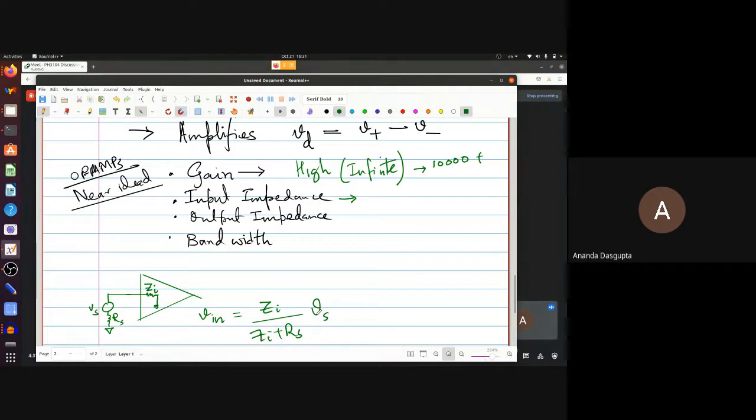Come on, that's a pretty straightforward and easy question. Why would you want the input to the amplifier to be large? For the output to be large. Good. Okay, that could be a good first starting point. After all, an amplifier can only amplify what it gets. The amplifier doesn't care how much Vs is, the source voltage. The amplifier does not amplify the source voltage. The amplifier only amplifies the voltage that it gets. So if Vin is larger, then of course it's going to amplify the larger voltage and produce a larger output.